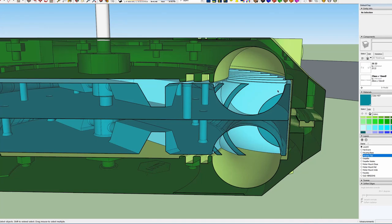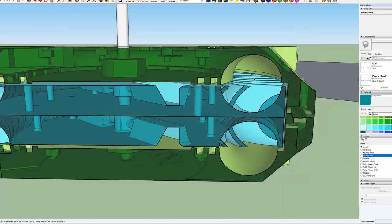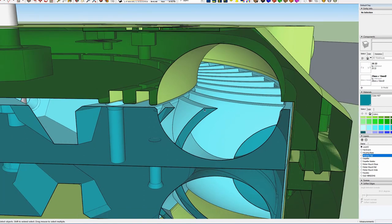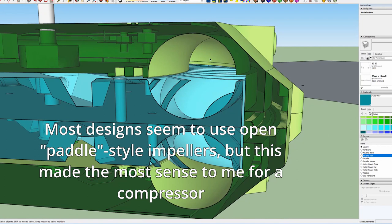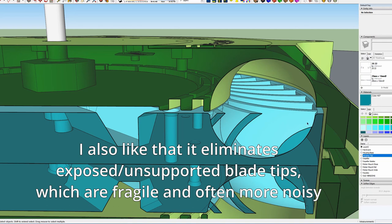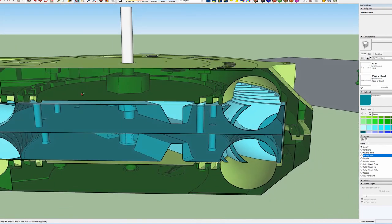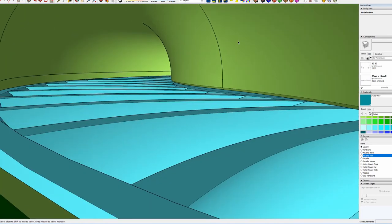So how does a regenerative compressor work? How can this compress air at all? When the impeller's not moving, these channels are wide open — you can blow straight through them easily. But once the impeller starts to spin, these blades start to scoop that air in. They move it forward, but they also move it outward. Except because of this channel wall — which makes a complete circle top and bottom — that air can't move outward. It's forced upward, back and around, right back into the blades. So now this channel isn't open; it's full of vortexes. Because of that, air can't move freely back through these channels. The blades keep working on the air, and it all gets shoveled out and funneled off at the exit.